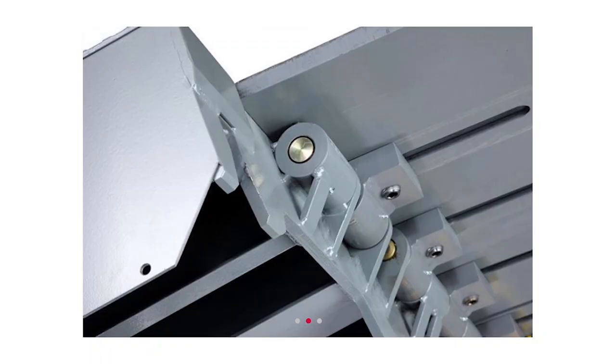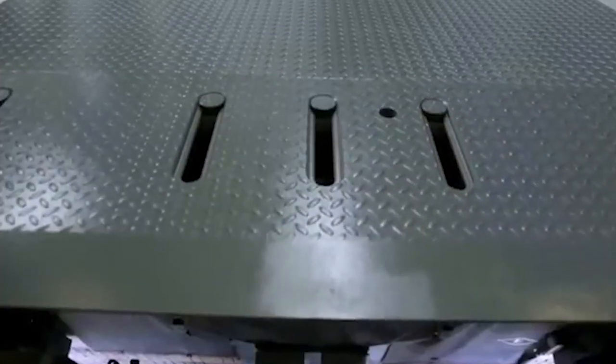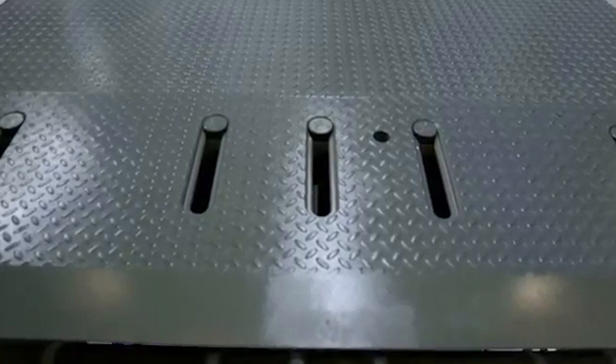Towards the front of the leveler, we've built in a two-point crown control, which helps to keep the front of the leveler a little bit flatter without harming the integrity of that front header, which flattens it out and makes it a little easier. And then we've also optimized our lip chamfer — the chamfer is the part of the lip that transitions from the thickness of the lip down to the trailer bed — and we've optimized that to make it a smooth transition from start to finish.